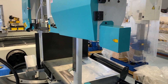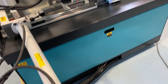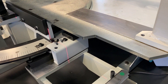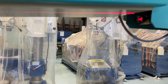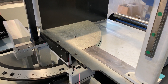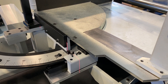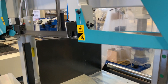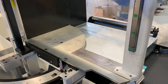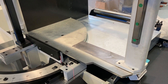You've also got a laser light on this machine. Let's switch it on — and you can see your laser there. It emits out from there and puts a line on the job so you know exactly where you're cutting. So instead of having to bring the frame down, put it up against the job, measure it, switch the lights on, and measure with where the laser is — then off you go.